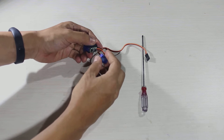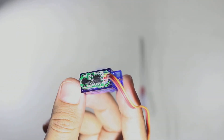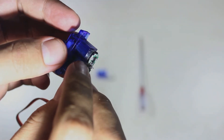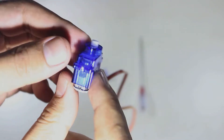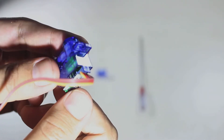After the case is open, we will look for the limiter. In a standard servo motor there is a limiter so the motor cannot rotate more than 180 degrees. The limiter is on top of the gear — right there on the top of the gear.